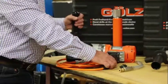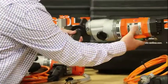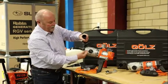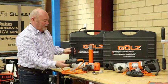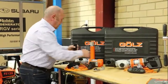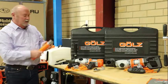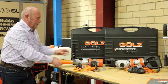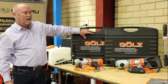There are two models: pistol grip and the D-grip. Both units are 2200 watts, they're three speed, they all come with inline RCD protection, thermal overload, and a front hand grip for handheld coring. They use the universal inch and a quarter thread for the core bits. Each unit also comes with a handy blow mold carry case for storing the machine and some accessories.